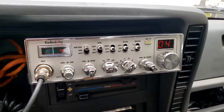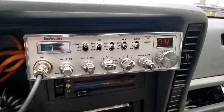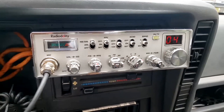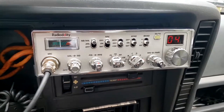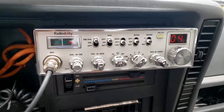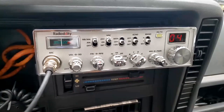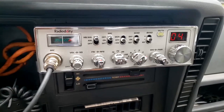Both of the radios we're using today — the QT-40 and the QT-60 — are running just the radio's power. There are no amplifiers connected to either radio. The QT-40 is doing about 35 watts peak and the QT-60 is doing about 60 watts peak. Both radios are set on channel 44, 27.4450. I chose that channel because it was the quietest today, though there was a lot of radio activity and we did encounter some noise.